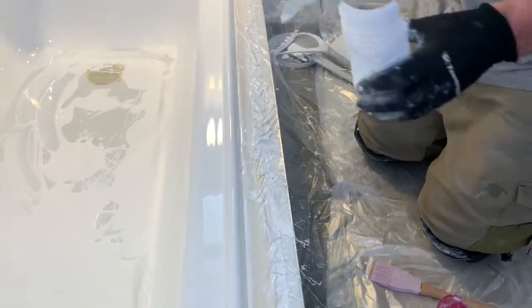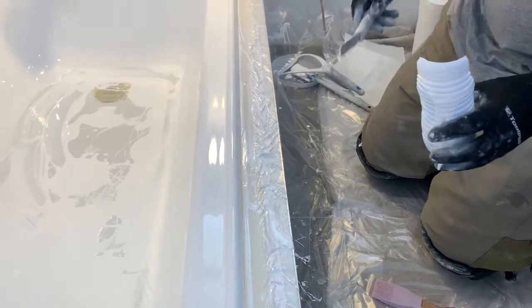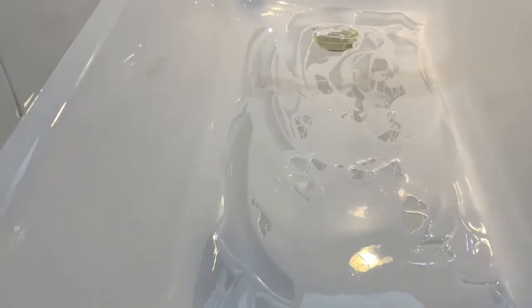It will keep coming down for another 15 to 30 minutes at least. But look — this is what's happening: the runs are no longer there. The run I was pointing out earlier has self-leveled — it's flattened itself out because the product is at a beautiful consistency, not too hot, not too cold, flowing beautifully. All we want to do now is make sure not too much pooling happens — like this puddle right here — this is what we want to try and avoid. In the finished job, right now it doesn't matter, but in the finished job it will.